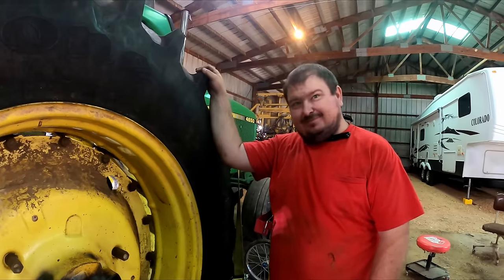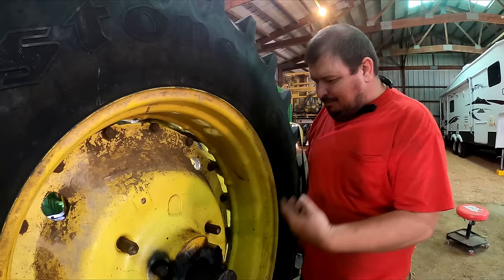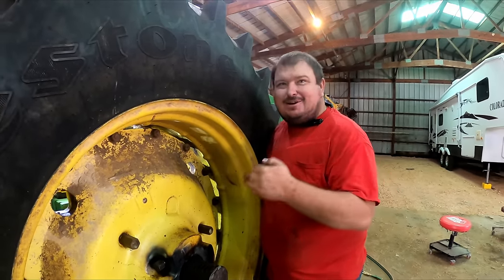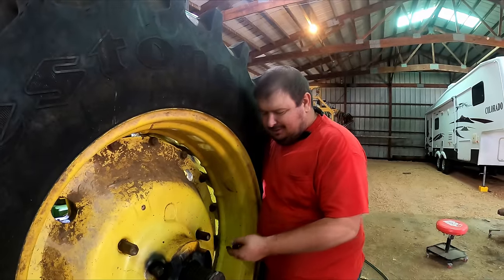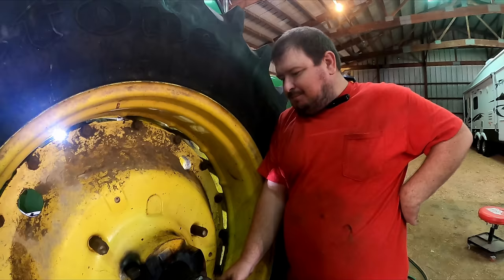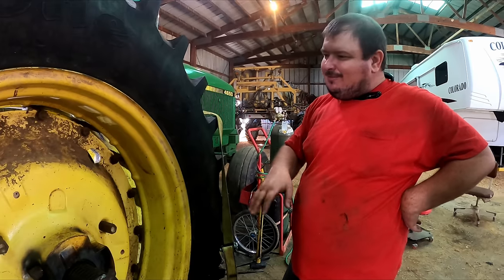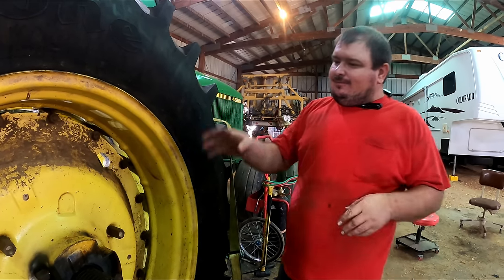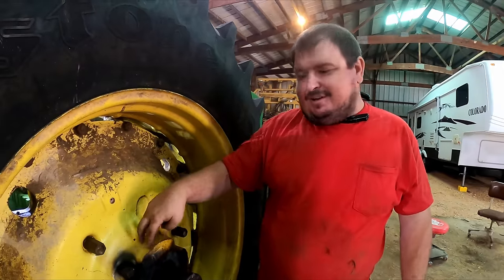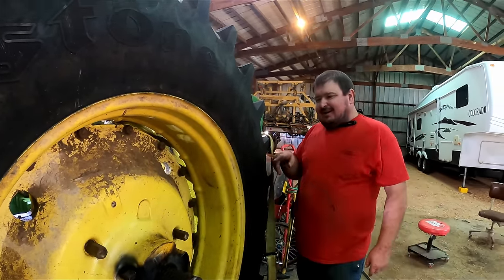But don't knock your bottom wedge completely out. The whole point of this was to tell y'all to run these bolts out here. But when your wedge starts moving freely coming out, start these bolts in, get you about two or three threads hung in that bottom wedge so it don't come completely out. And Bubba told us this, but I forgot. When you knock that bottom wedge out, it'll let this wheel teeter. And then your gear in here won't engage your axle, and it'll just freewheel in there instead of walking it down the axle.